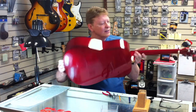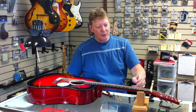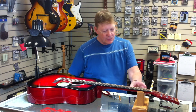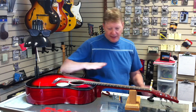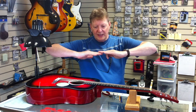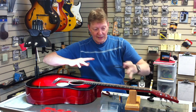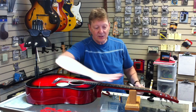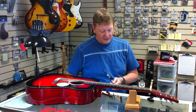I'm going to check the height — looks great, that's wonderful. That's just a visual cue. Having the capo at the end simulates where it's going to wind up eventually anyway, so we're very much in the ballpark. We're going to cut that nut now. I don't have the strings up to full tension, so the instrument is in a bit of a float state. Once I get all the adjustments made and get it up to tension, the neck is going to come up a little bit, the truss rod is going to load, and everything is going to be more or less at its final living condition.